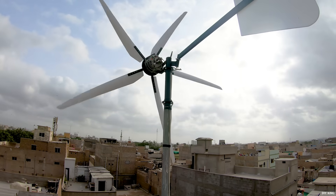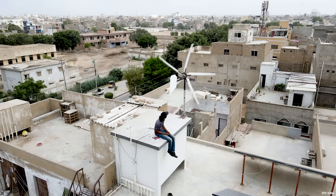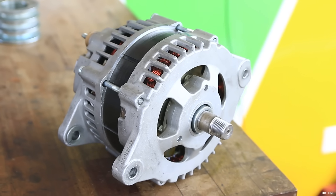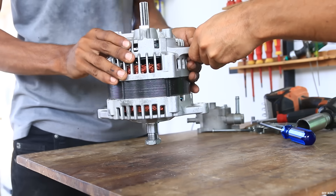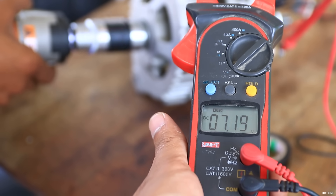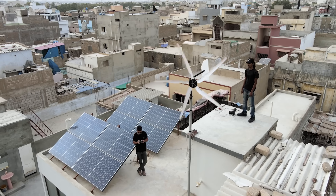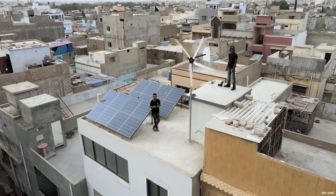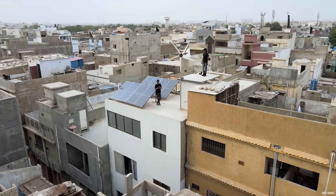We were aiming for 700 RPM while the turbine initially achieved only 200, so we switched to shorter blades which did increase the RPM, but we were still halfway down at 350 RPM. The maximum output we were able to get was around 50 watts, which barely compensates the power we are using to magnetize the rotor coil — way less than expected. Using a car alternator for a wind turbine might not be a good idea, but there are some tweaks we are looking forward to: replacing the current rotor with a permanent magnet one and increasing rotor speed using a higher gear ratio between the blades and the alternator. That's something we'll cover in another DIY project video. Drop your suggestions in the comments below — hit thumbs up if you love the build, and we'll see you soon in the next one. Take care.